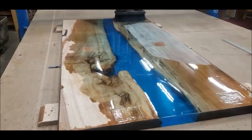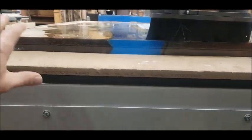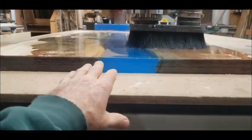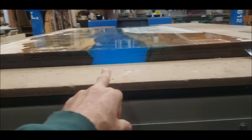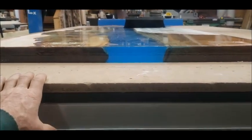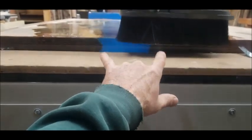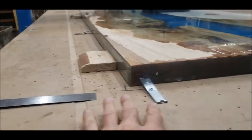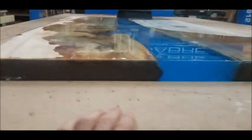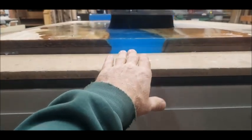Flattening another river table - I do a lot of river tables. What I've noticed is these are typically coming in cupping this way. This was poured in position in a form, and you can see epoxy all the way across the top but hardly any along the bottom, because the boards were pressed down into the form and people overfill them. They don't put a dam down the center. I've had to pull the sides down on both sides - I put little clamps to hold it down to the table, pulling it back flat, probably an eighth of an inch each side.